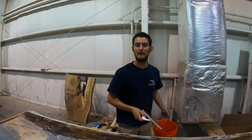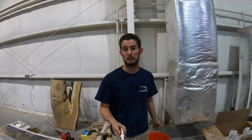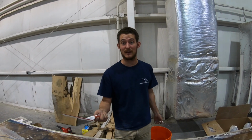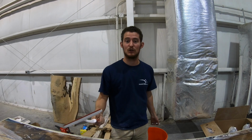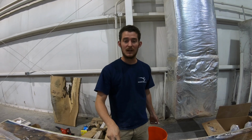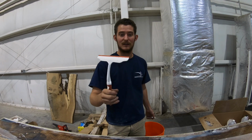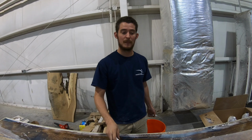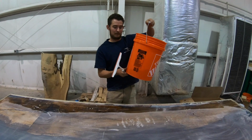Now, you might be asking yourself, why is he using casting epoxy? Why wouldn't he use like a tabletop epoxy? What I've come to find out is, yes, casting epoxy takes longer to set up, but it saturates and soaks more into the wood because there's a longer set time. So you have a much stronger bond and it stabilizes the wood better. Plus this wood here, it's kind of punky, which means it has a rottenness to it. And so we want to make sure that it's stable being inside a home, okay? That's why we're using it. Here we go.